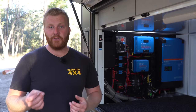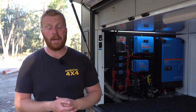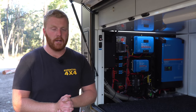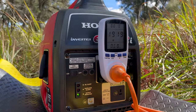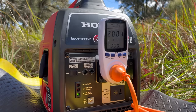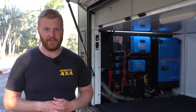We've covered how we can use and draw down that battery capacity, but what about charging it back up again? As mentioned, we can put in 120 amps back into the batteries through that 240-volt charger, and 120 amps is also important when using it with a generator. I carry a Honda EU22i generator, and the 120 amps represents a full 2,000 watts, which means that generator is working at 100% load. Of course it burns through fuel quite quickly, but it also means we can charge up those batteries just as quickly too.